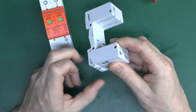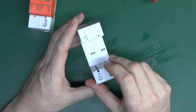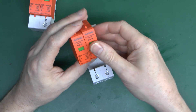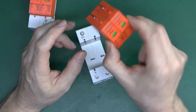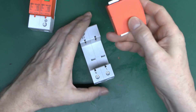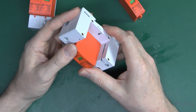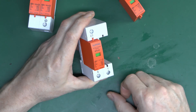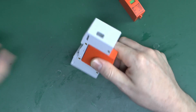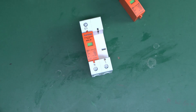This thing basically comes with an outer frame which just clips onto the usual rail in your consumer unit, and then it has these cartridges which are replaceable in the event of these things failing. These are not permanent items - they do wear out and become damaged as they absorb the energy from surges. These just slot in here. In theory you can replace these after a period of time, but these particular ones are incredibly difficult to get out without prying with a screwdriver from the back. Nevertheless, theoretically it's a replaceable component.